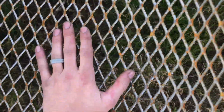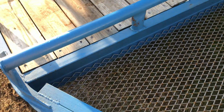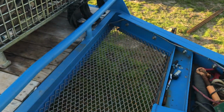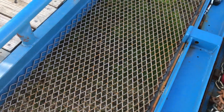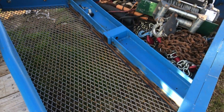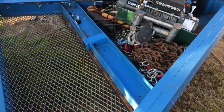Probably one or two cross members in here, but we'd probably be alright. I'll get it welded up and then I'll see if I need them. But yeah, that's going to work out pretty good for us. It's just going to lay in there. I'm going to go get my little MIG welder with the flux core so I can run all that stuff. I don't really feel like stick welding it when I've got the flux core. I should have cleaned off the paint, but it'll be alright.